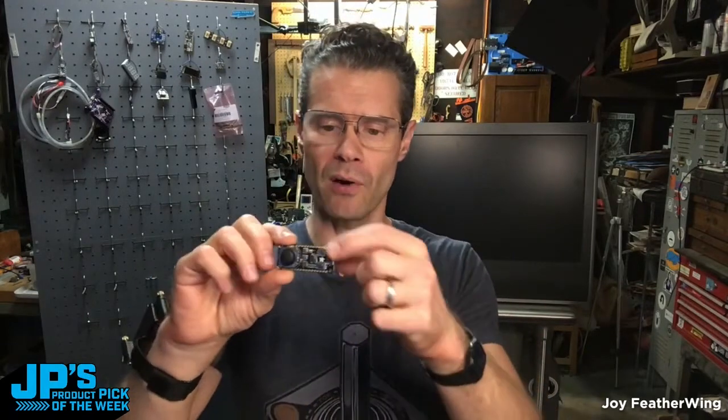This is the original seesaw board — a little seesaw chip that is taking care of finding out what's going on on the board, in this case collecting the analog input and those five button presses, and then sending all that info over I²C.